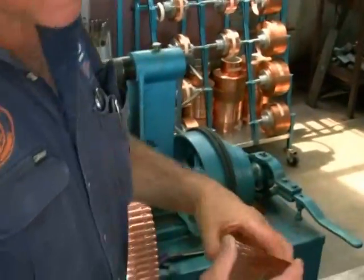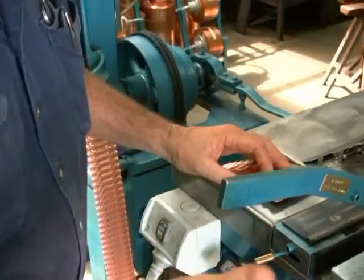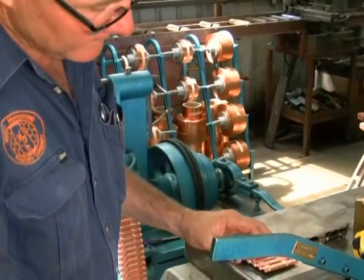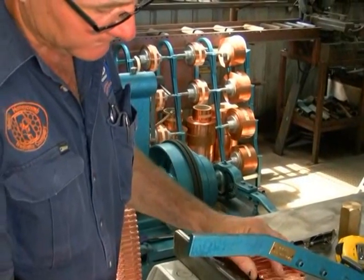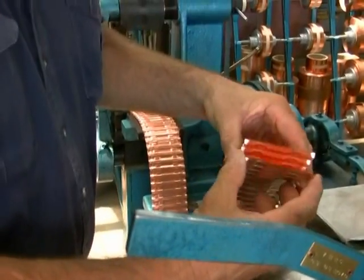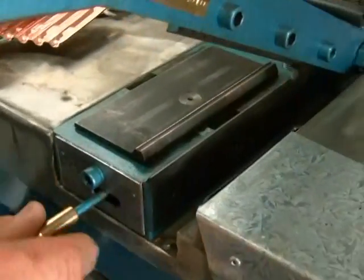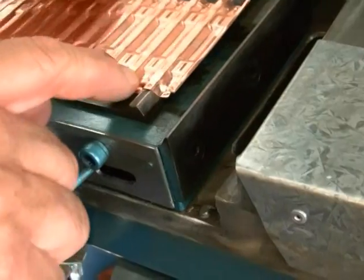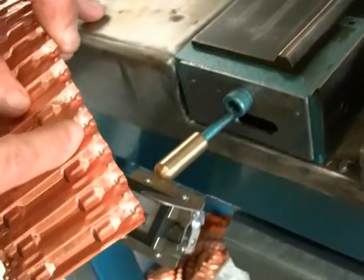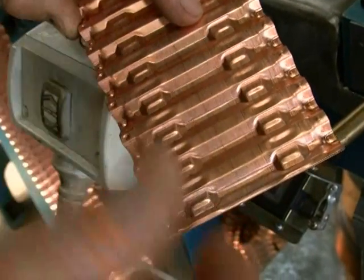After the material is pressed, you'll see it's two layers at a time. It comes through this little guillotine, which is part of the original equipment. It's indexed for different reasons. The copper is done in two layers at a time — you can see there are two layers of copper. This indexed guillotine slides back and forward, so it locks there and cuts in different positions. That's all to do with the assembly dimples on the core. You'll see male dimples down one side and a male-female dimple on the other, which are part of the core assembly process.